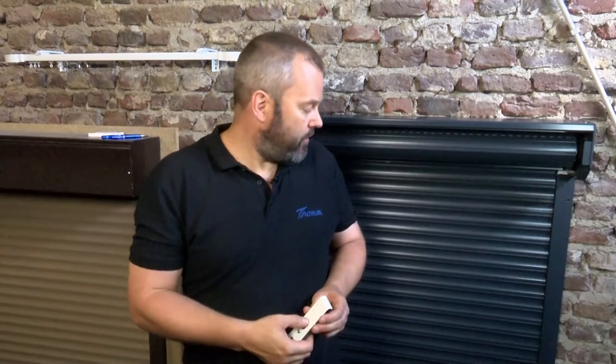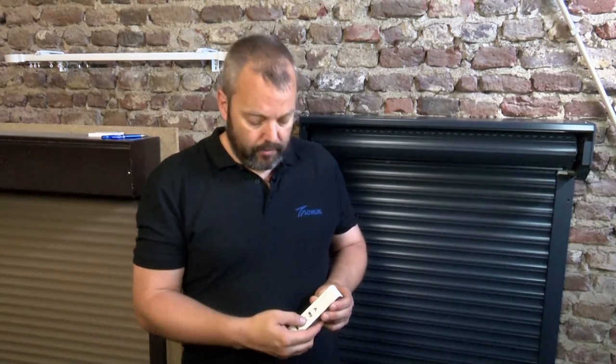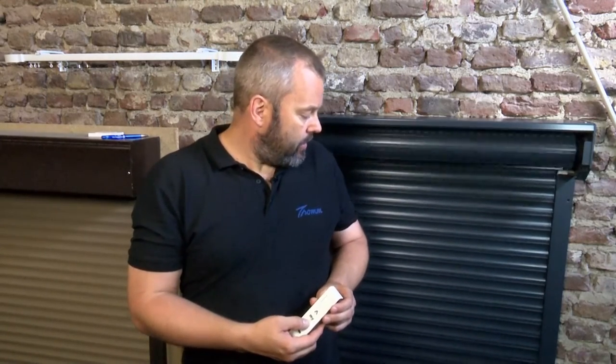So I'll test it to see if the directions are correct — no, they're not. So what has happened is, when you have a small roller shutter, one that's very light, the motor cannot determine which side is up or down because the difference in weight is too small. So the motor works about as hard to roll it up as it is working to roll it down. So what I need to do is to help it know which side is up.